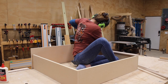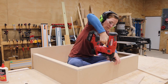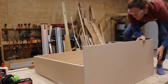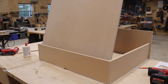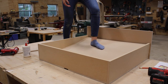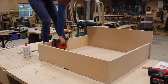For right now I only placed four pieces of trim on and left a gap in the center. This is so I could flip the entire thing over again, moving the unit to the edge so that it can lay flat. Then I applied more glue to the inside of the overhanging trim boards — these trim boards will catch a panel that will eventually become the front of the unit. Mine was a little tight but it's nothing a little stomping couldn't fix.